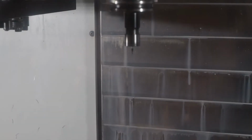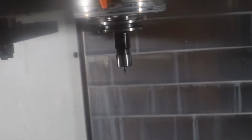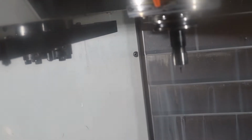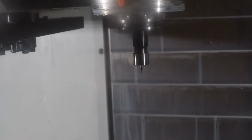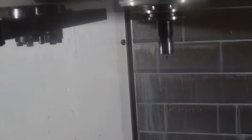Alright, next is the slotting. That should be interesting. This is a 3/64 cutter, 4 flute, square end, and it is 0.04687, that's what the diameter is supposed to be, but that's what 3/64 says. Yay, Imperial! So I'm gonna try these speeds and feeds. It's a brand new cutter, and if they're incorrect, it'll probably immediately just break the cutter. But we will find out.